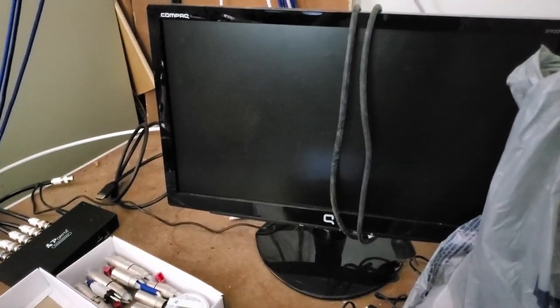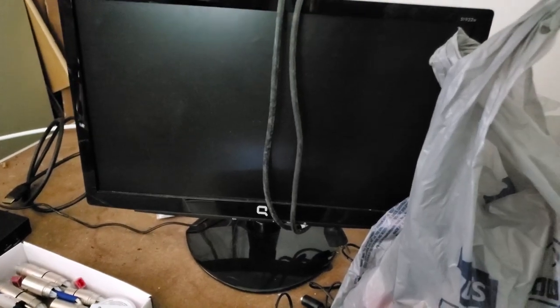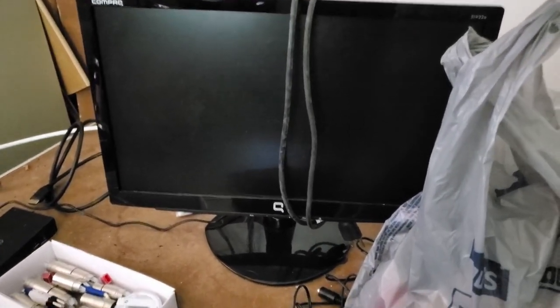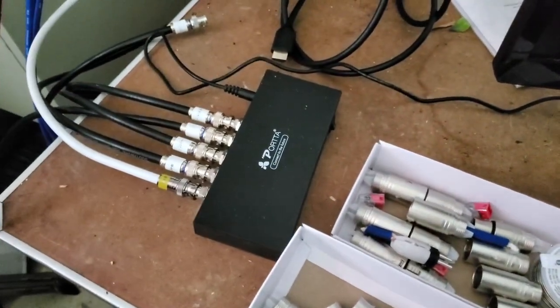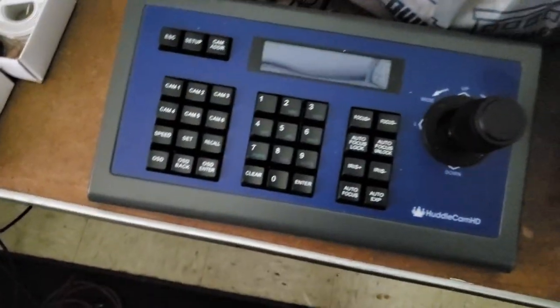The TV isn't here yet but we tested it and it is connected to the SDI splitter, so we should get a signal. We have another SDI-to-HDMI adapter that will plug into that. We've got the POE switch right there with the jack running from the cables pulled over there. Right now it's the back PTZ plugged in and split to all the TVs. The extra cable is for the front PTZ so whoever's operating can see exactly what's being captured.